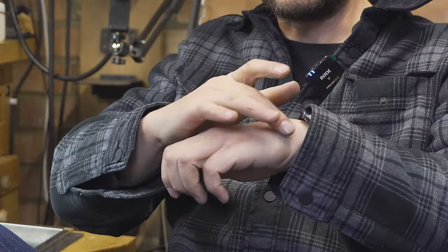Once I'm finished with the stipple finish, I take it out of the shellac and clean it up again, working it on incredibly fine sandpaper — we go right down to about 3000 grit. What I'm doing by doing this is eliminating the process of having to do it after I've added parts onto it. It's easier when working really tidy to do a quick solder and not have to worry about scratches left behind by a rougher sandpaper. So we go right down to 3000.